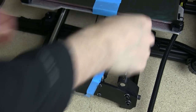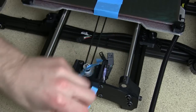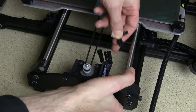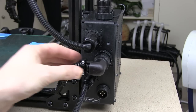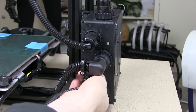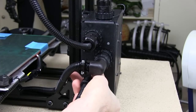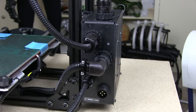Looking at the back of the printer, we need to take off this blue tape, which is for holding all the parts on in transit. That covers the home switch to make sure it doesn't get knocked. We've got these connectors which are keyed and have little catches on them, which connect up with the motor. The connector configuration is quite different to the TAZ-3 — we've got these lovely big connectors with latching connectors that only fit in one way, and once in, you screw them up to keep them nice and secure.